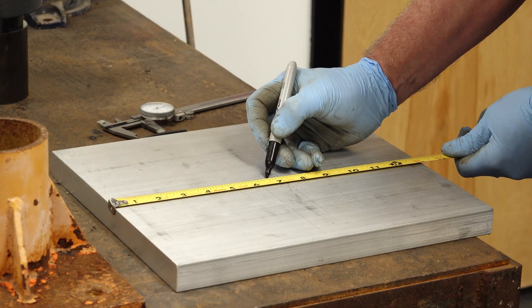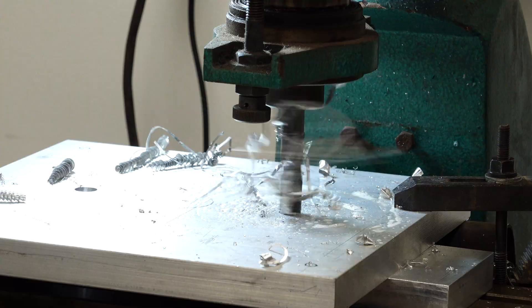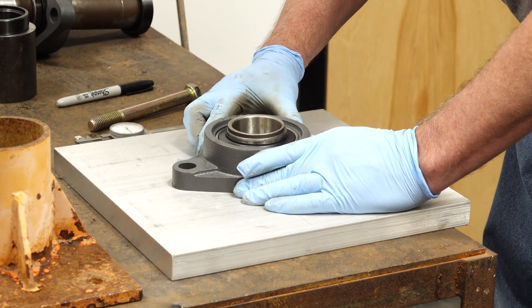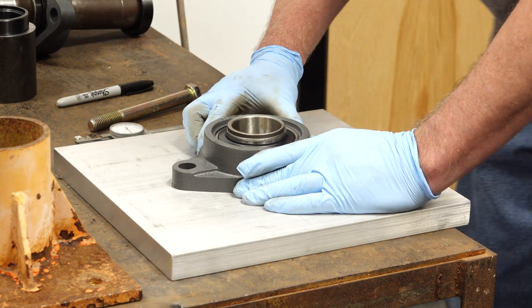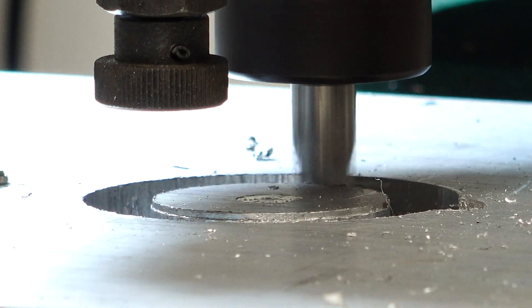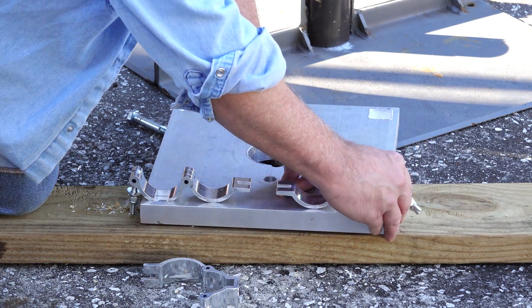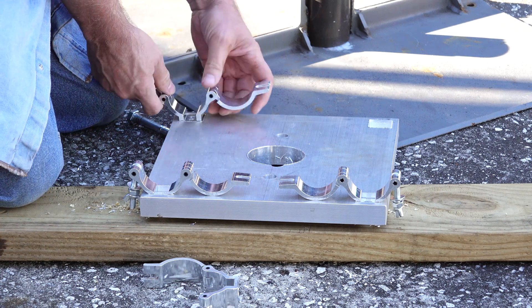First, I measured and marked all the holes I needed. Then I drilled two holes to attach two heavy-duty flange roller bearings that I bought for $26 each. I wanted to use tapered roller bearings, but they were $250 each, and I figured you probably didn't want to spend an extra $500 when it really was not necessary. Next, I machined a big hole in the center for the main shaft. Then, to attach four standard truss lighting clamps that I bought for $5 each, I machined square notches in each corner to recess the clamp and make sure it would not shift under load.